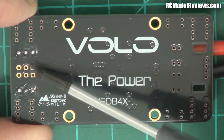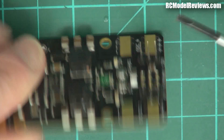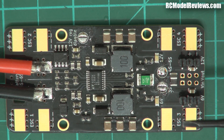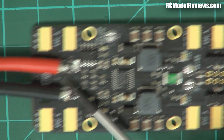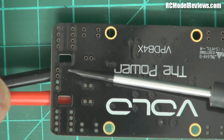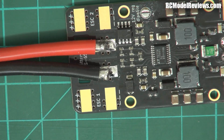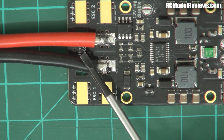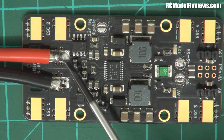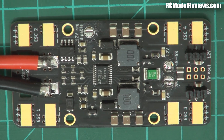There are a few connectors here — I've already soldered in a couple of pins. These are designed to take servo-type header pins; they give you those pins so you solder them in and use ordinary servo connectors to plug into the board. Over here I've got my main battery connector with these big thick beefy wires. You notice there are some holes so you can run a cable tie through to mount it firmly to the board, so plugging and unplugging your battery won't put strain on these gold-plated copper pads. That's really good for reliability and longevity.